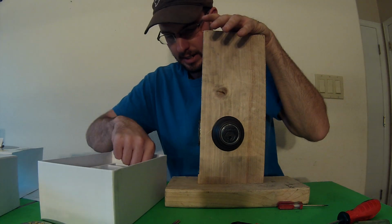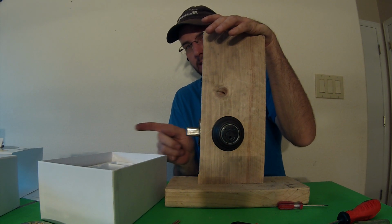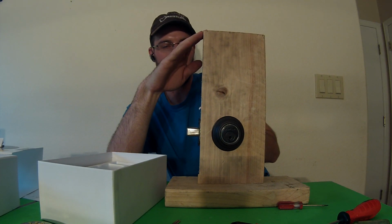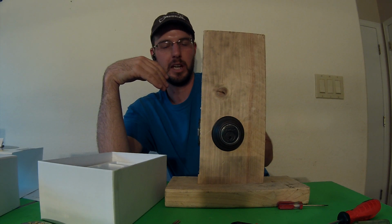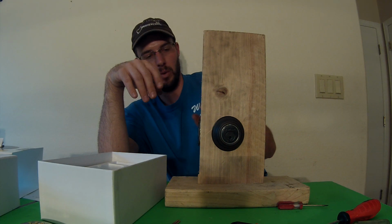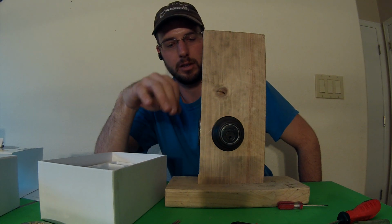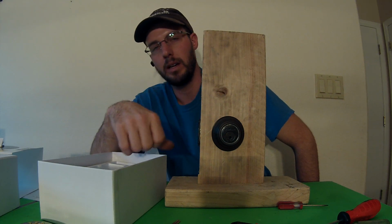That's the installation process. You'll need to make sure on your regular door that the bolt slides into the jamb very, very easily and smoothly when the door's in the shut position. You don't want to have any resistance there. It should open and close while the door is open and not in the jamb, just as easy as it does while it's in the jamb. If that's not the case, you need to adjust the hole or adjust the plate in the jamb where this is going into to where that lines up absolutely perfect, or this electronic lock is going to get destroyed in no time. Super, super slick, super, super smooth. That's the way that this has to be set up. If it's set up that way, you'll be good to go.